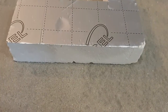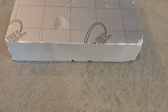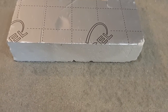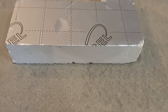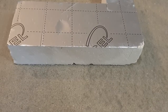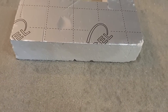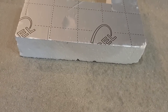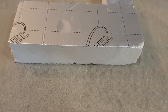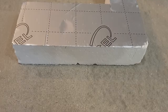Let's have a quick look at the insulation itself. For the walls and the ceilings, we're using rigid insulation which comes preformed, and it's polyurethane. It just gives you the best thermal capacity that you can find - it's very, very dense. It's solid but you can break it. Compared to what we put under the floors, this stuff is much lighter and easier to manage, but you have to cut it to size.